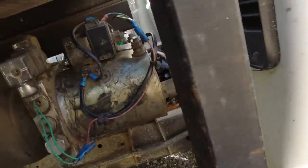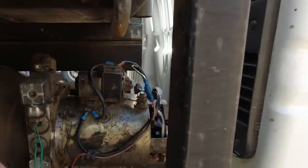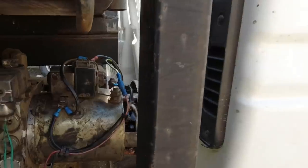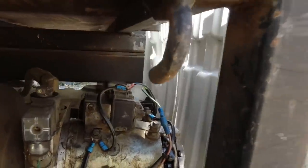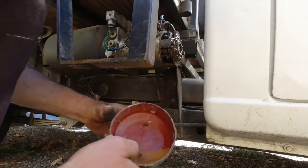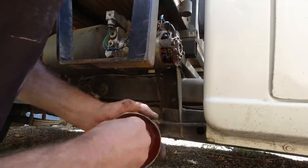So it was just those stuck brushes that weren't contacting the commutator properly, and that was caused by water getting in there and corroding it. It looks like they have tried to seal it up before. I think the best way is to put a little cover over it to keep the rain out — no water is going to get in there then. Because I don't want to risk water getting in there again, that's obviously quite detrimental to it. Those are probably quite expensive to replace. I'll just fabricate a little cover over that. You can see the rust line showing where the water was sitting — it can't get out. So if I drill a hole in the bottom, any water that does get in is going to drain out.